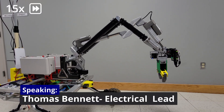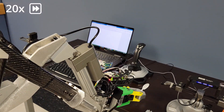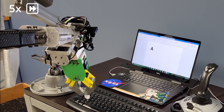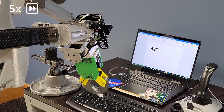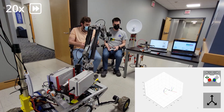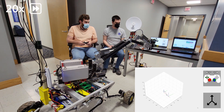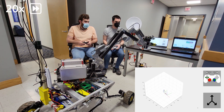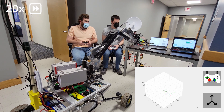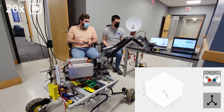In order to control the arm, we developed our own inverse kinematics solver. It uses the inverse of the arm's Jacobian to implement resolved rate control, which has a closed-form analytical solution and can be easily mapped to controller joystick axes. This offers a significant improvement over typical position inverse kinematics, allowing intuitive real-time operation with a game controller instead of a slow plan-and-execute control scheme.